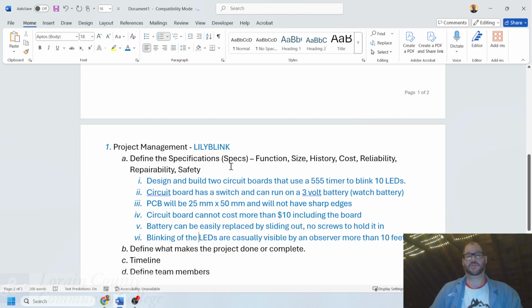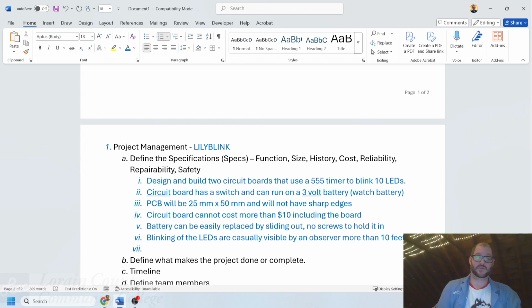So I won't get into much about the repairability and the reliability. Safety-wise, I will get into something. Circuit is built from RoHS solder, right? RoHS means restriction of hazardous substances. Solder, frequently from a hobbyist perspective, is lead-based, or the element lead. In the periodic table, it is capital P, lowercase b. This is a carcinogenic material that is overall easier to make prototypes with, but however, is a toxic material, and I want to avoid some contact with it in particular for this project.